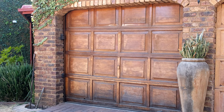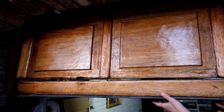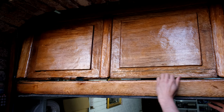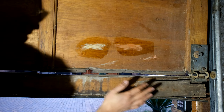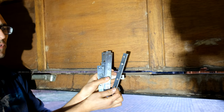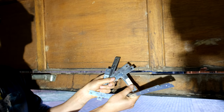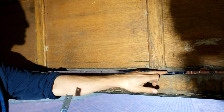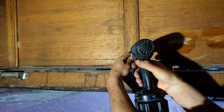Now this second garage door needs a little refurbishment. You can see at the bottom here it's broken off, so I'm going to do a quick repair. Ideally also varnish in here or put some sealant because you don't want water going in and expanding the wood. Unfortunately this section is all rotten. I'm not going to get a new piece of wood — I'm just going to support it with brackets. Here I've got some galvanized steel T-junction brackets, and I'm going to screw them in. The wood at the joining point is where the problem is.